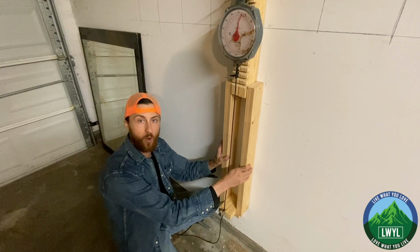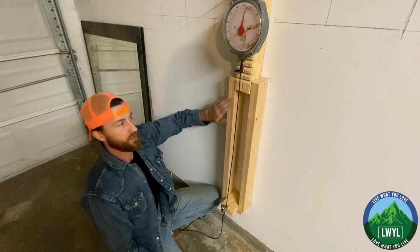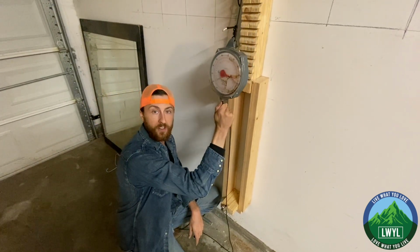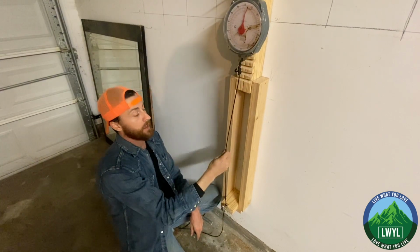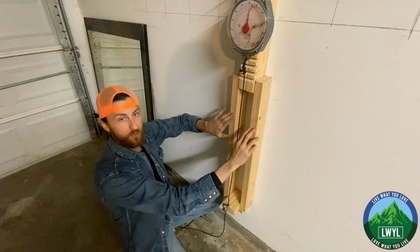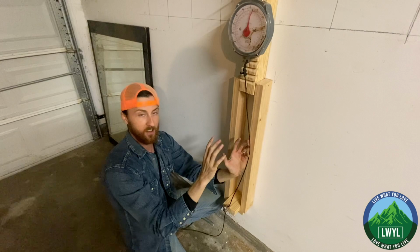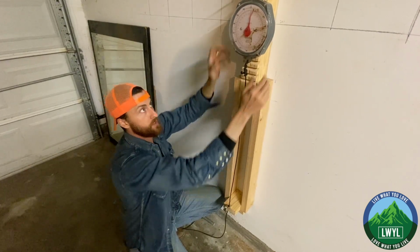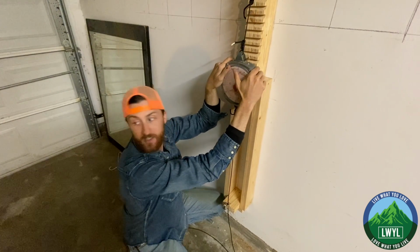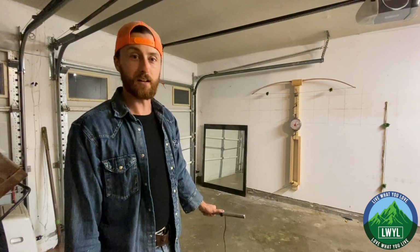I know I didn't really go over these two 2x4s. The purpose of these, it's not structural. It's because when you pull this, you're pulling your line down, and you're applying force. Before I had these two boards on, the scale would get to this point, and then it would start twisting. So the whole reason for these boards is so that when you're pulling down, the scale stays with the face pointing towards you. I hope this whole thing helps, and see you guys next time.